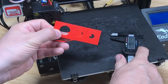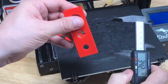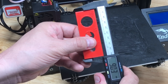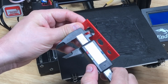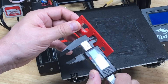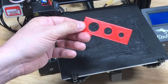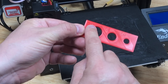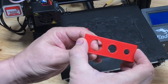So now what about the dimensions? Let's check: 32 — that didn't change. Slightly smaller, could be how I had it positioned — 90, pretty close to spot on. Now the holes: 20 millimeter hole — 20 millimeters exactly. 15 millimeter hole — 15 millimeters. 10 millimeter hole — 10.1, essentially 10 millimeters. So the horizontal expansion worked great — only affected the holes, and then the zeros on the 20 and 10.